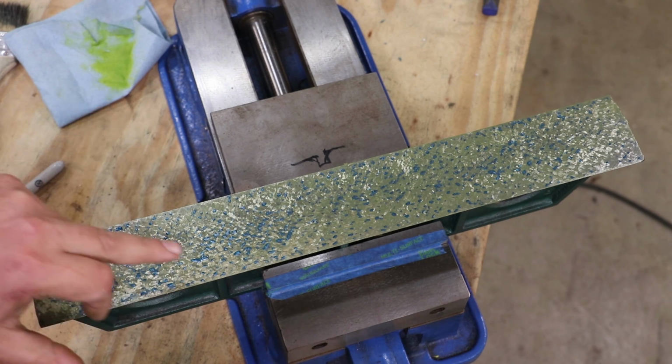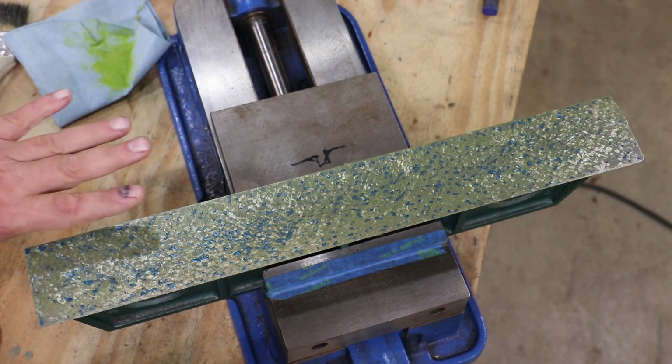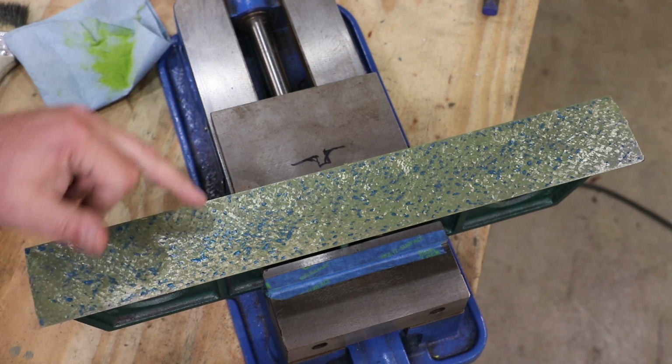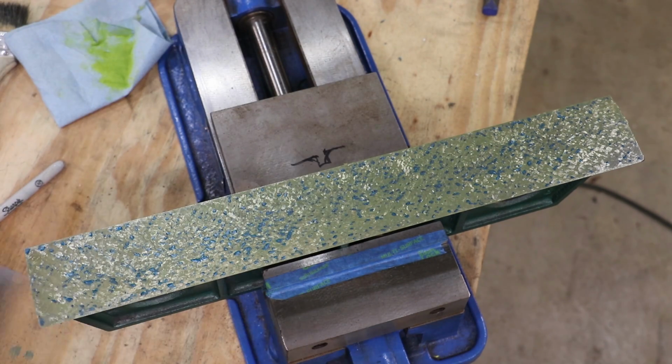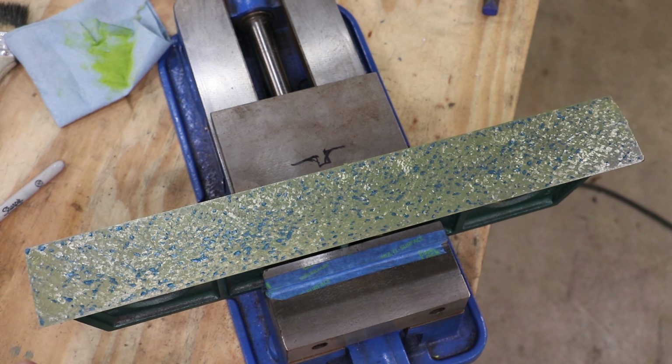Basically, we're not trying to eliminate all these points. I'm just trying to cut them up into smaller pieces, and at the same time that should lower these down and hopefully bring in some contact in the areas in between as well, because they're all really, really close. They're probably all within a couple of tenths of being on the same plane. But of course, we're just hitting the highest points right now. They call this sometimes the technique 40 method to get to 40 points. And that's what we're trying to do here.